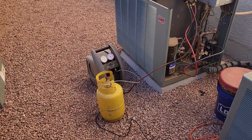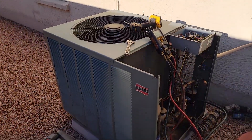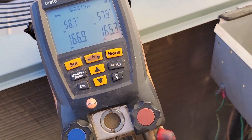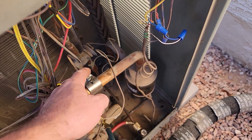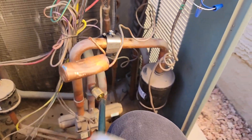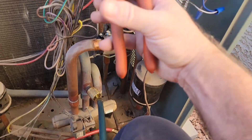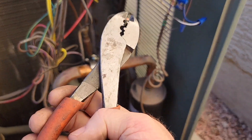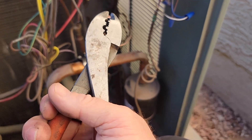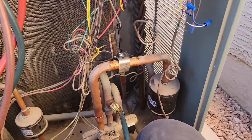Old, tired Ritchie Yellow Jacket recovery machine — knobs are long busted off, but it still works. The goal is to get down to like 5 psi or so, just above atmosphere. Enough to give me time to unthread the bulb here and put on a new one. Well, it had a little bit of pressure — it wasn't flat. Hoping it had none because that's usually a dead giveaway. Still could be so low that it can't oppose the spring.